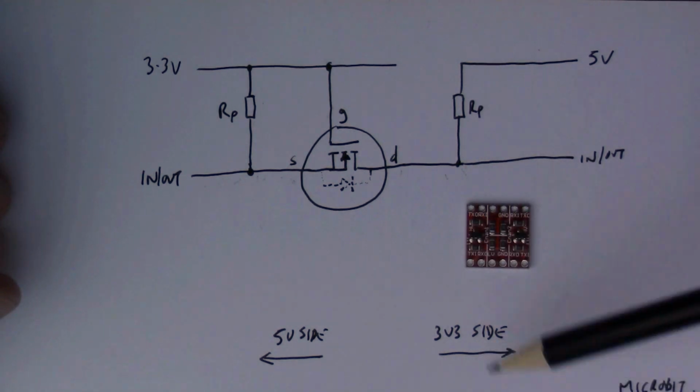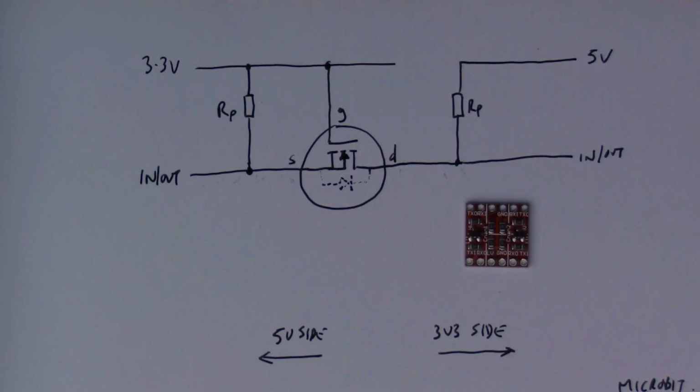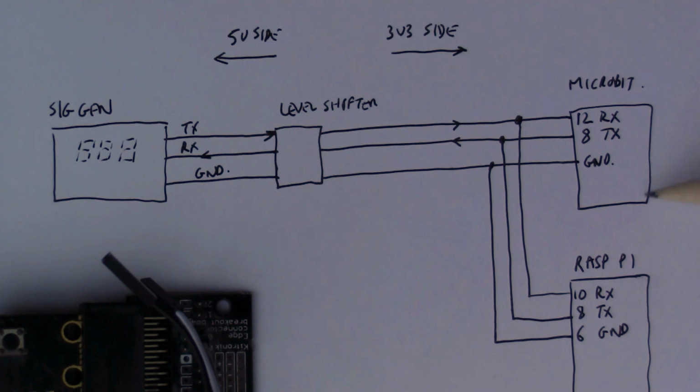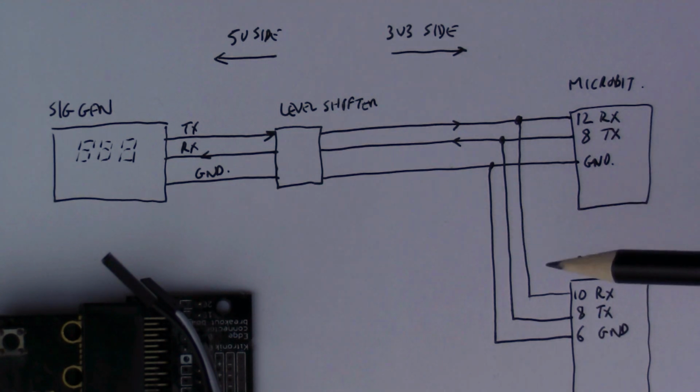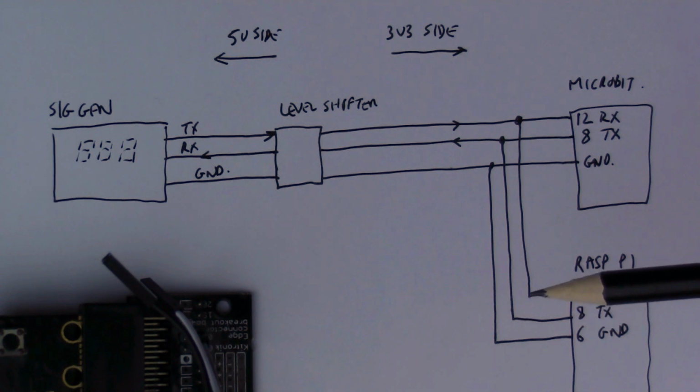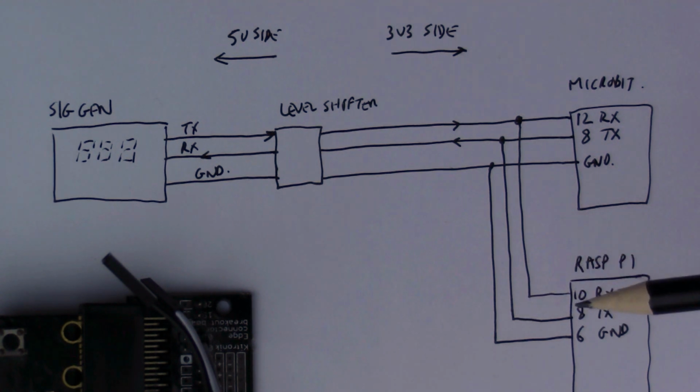Just to finish off, let me show you the diagram of what we've created here. We've got the signal generator over here, we've got the level shifter, and these are the two setups that I created, the microbit and the Raspberry Pi. If you want to build it yourself, here are the various pin numbers so that you can construct exactly the same thing. The code for these two sides, the microbit and the Raspberry Pi, I've uploaded onto my GitHub site. The link is down below in the description, and I've also put a link to the application note that describes how the level shifter works if you want to look at that in more detail.